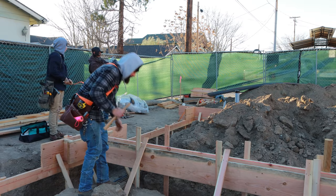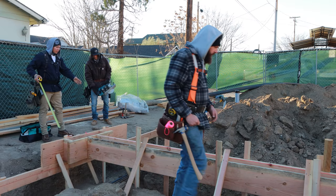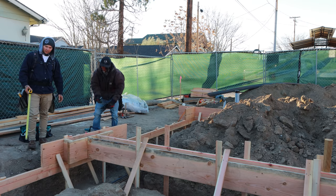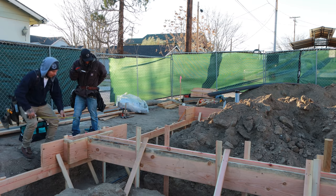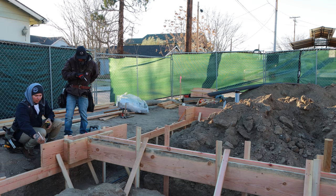So you're gonna run that 2x6 from all the way under there over to right here. I have that mark up top for you. That's where our 53 starts for our spread footing. We'll probably end up putting two across the bottom just to save on some concrete. 2x6s. This side, it's same exact thing. So off of here, 53. Okay. So our spread footing right here is 53x33. So we'll come out to there.